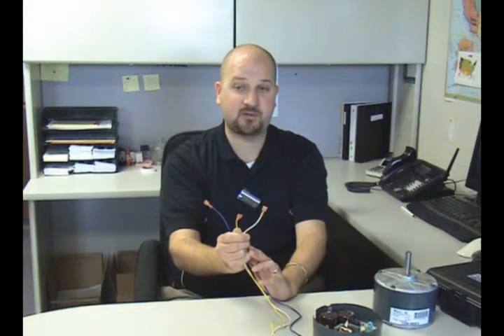There are two different methods to hook up your VZ7 between the system board and the motor using these adapters. You will use either one or the other, not both at the same time. The method you choose will depend on how difficult it is to connect to this particular piece of equipment or whether the motor has been removed. For method one, the signal connections are usually made with three wires, often colored blue, white, and yellow. If the signal wires are connected to the system circuit board with standard quarter-inch quick disconnect terminals and the circuit board is easily accessible, it's best to use the adapter's quick disconnect terminals and not the red and green connectors.